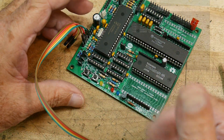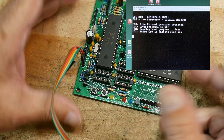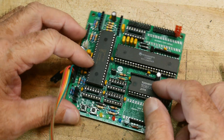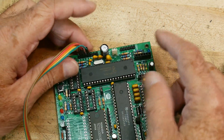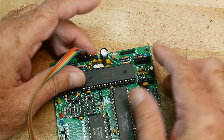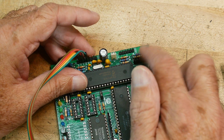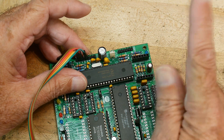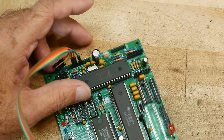Here's a picture of what you'll get when it comes out — it says it's running. But then it stops and it won't do anything, because it's looking for the floppy drive, which is going to be emulated with this SD card. I don't have a board; I looked around and couldn't find one, so I ordered one. The A drive will be on this connector here. If I want to add a real-time clock, I can plug it in here.